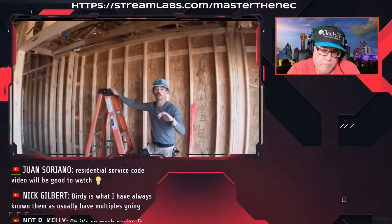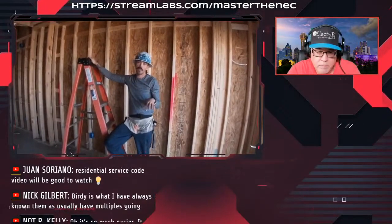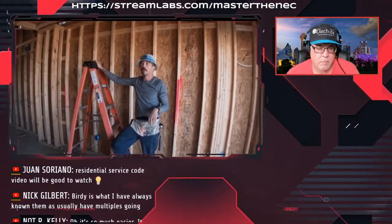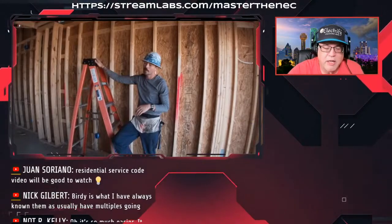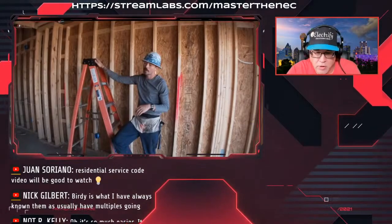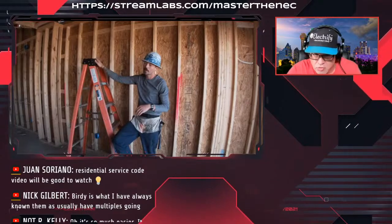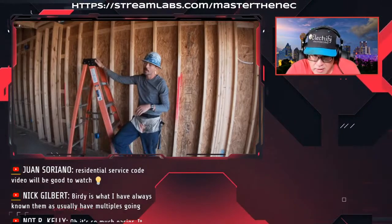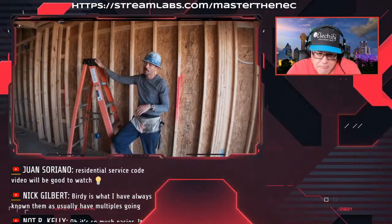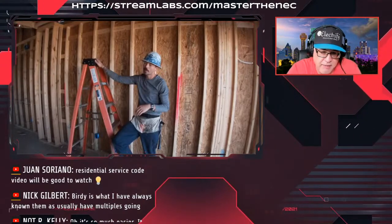And when you're running long runs up in the ceiling, the code is you're supposed to have a staple every 4 feet. Okay, I'll correct him here. When you're running non-metallic sheathed cable under 334.30, you need to make sure that you secure and support it. Generally, you support it every 4.5 feet, and by virtue of that, you'll be securing it every 4.5 feet.